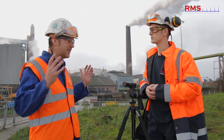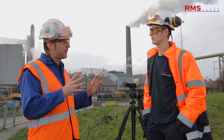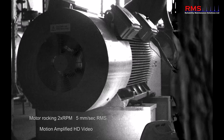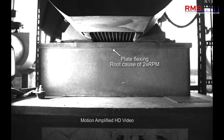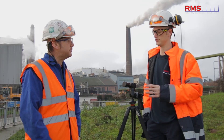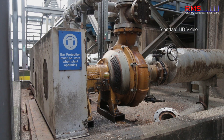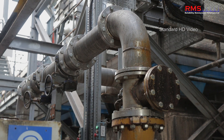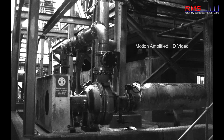For Stuart, this is totally new technology — he's seen a few videos and it's blown him away. The big point is how visual it is; we're looking at machines in ways we've never done before. In the past, we'd get a few readings — 10 millimetres per second here, 20 there — but this shows how the machine is actually moving. It's comparable to ODS, giving us the ability to visualise the machine's motion.